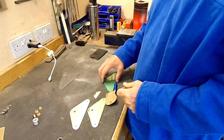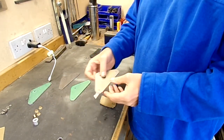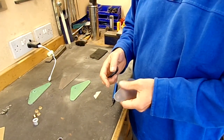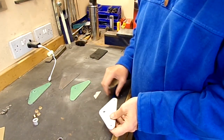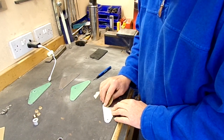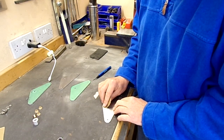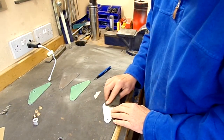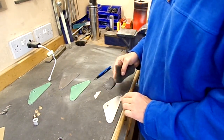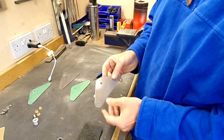That one's going to be washed down with methanol to clean it, then it's ready to be etch primed and painted and assembled. This one's got just a couple of little marks on here — it'll need to be deburred as well on this front face where it's got a scratch. I'll go through very lightly with 600 grit to get rid of those scratches and then polish that off, using fine scotch brite to get rid of any surface scratches.